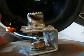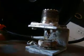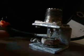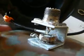Basically it's a very simple hookup. You have a lug connector from your braid that goes to ground, and you just solder the center of the coax to the SO239. Really quick and easy.